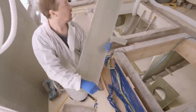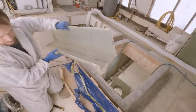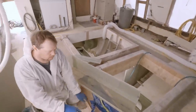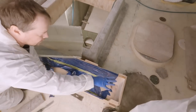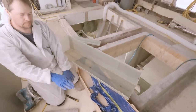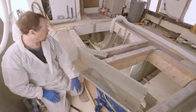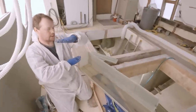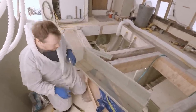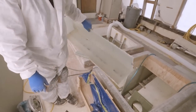Sweet. Well, the form's in good shape still. Yeah. Fresh layer of tape and a couple of slap-ons of PVA. The next one, well, we needed to retape it anyways because we're going to need to pull the form from this side. We'll get a measurement. We might be able to go a little bit shorter back there, but not much. There's a taper to our floor in relation to the sump, so it's deeper at the front, shallower at the aft end here. But this first part is just to get this, and we'll just trim off any excess. Let's go see how it fits, yeah?